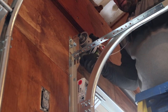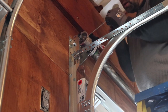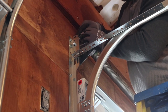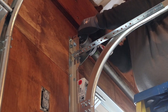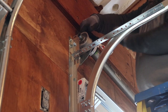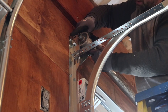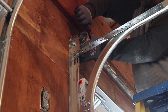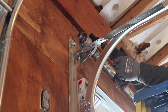I've got my cable attached to the bottom of the door and I have to get it wound on the drum. There's a set screw on the drum — I want to get the drum centered inside that flag bracket so it doesn't rub. Once it bottoms out, go about a turn, then wind it about another turn to keep tension on that cable.